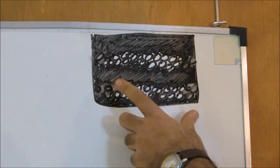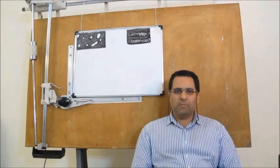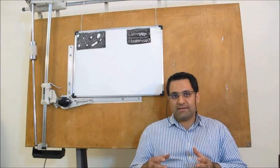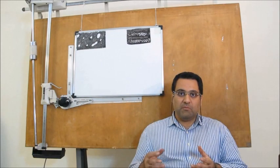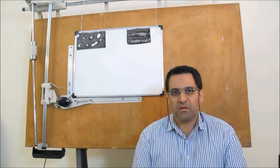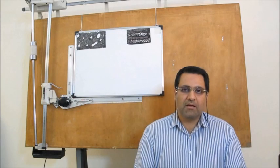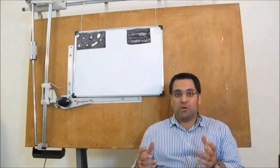Each line is separated about a few hundred micrometers from the next line. The most important property a sword material needs to have is ultimate strength — the maximum stress it can tolerate before breaking into two pieces. Fulade Juhardar's maximum ultimate strength is about 1,000 MPa, which is about 20% more than modern steel alloys of the same composition.